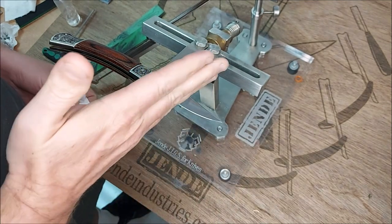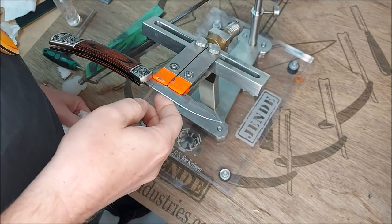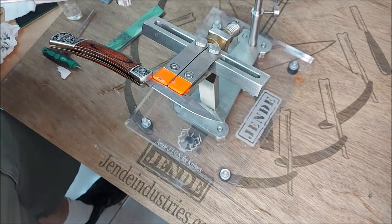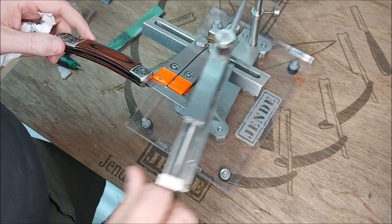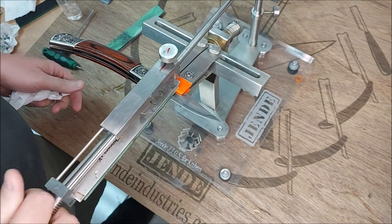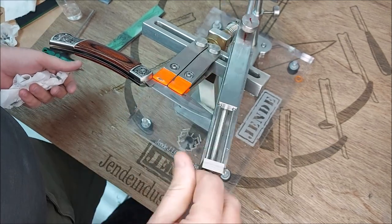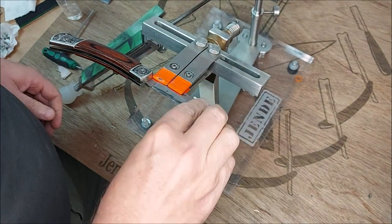So right now again, scratches are going back this way. And ideally, none of them are the 400, and hopefully none of them are the 120 diamonds still. But this is the way to do it if you want perfection. You've got to go straight forward first and then askew, forward, askew, so you can cancel out previous scratches. Because the finer you get, the more of a diminished return there is. The finer it is, the less scratch it has, so it can't bottom out as easily as a coarser grit can.